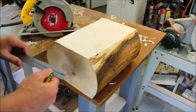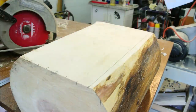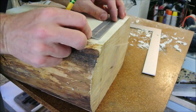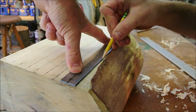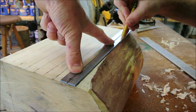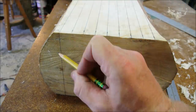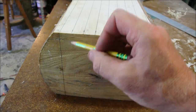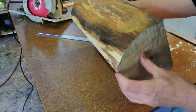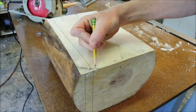This part will take a little bit of judgment — a combination of measuring and head scratching. I'm marking every three quarters of an inch, and I'm not making an allowance for the blade. So all of these pieces will be three quarters minus whatever the blade cuts away. This last one is still usable material — we're making birdhouses, not space shuttles. Don't square them all down, just square one. This is our reference line. We'll use that to mark from, and then once both sides are marked, we'll connect the lines together. This one set of lines goes all the way around and it's my reference mark. I will pull all of my measurements from that.